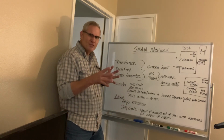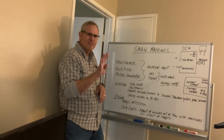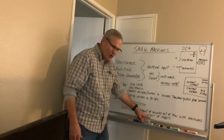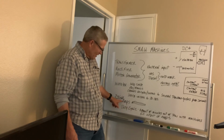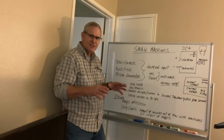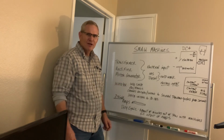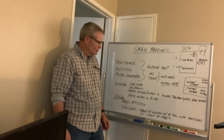That 20% means 2 minutes out of 10. That 40% means 4 minutes out of 10. And we're looking at the machine's full output of amps. So be sure you're buying a machine that has enough amps and the duty cycle that will balance the amount of minutes out of 10 that you actually want to require the machine to be used for.